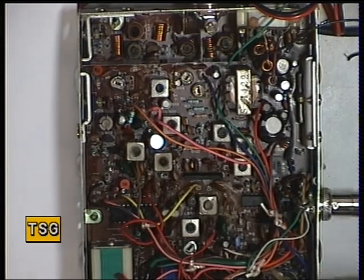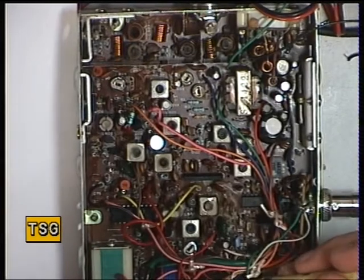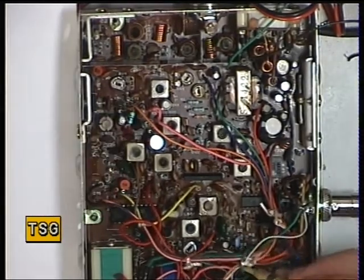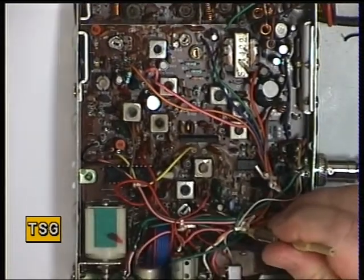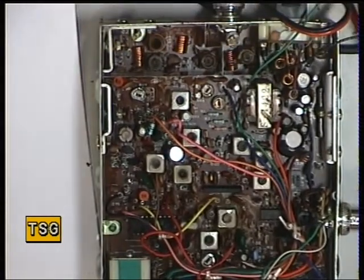But if it wasn't, there's a preset just under the wiring harness — I can't quite see what RV number it is, but rest assured, just under the wiring harness there is the preset for the squelch. And that concludes the Harry Moss PT325 receive alignment.